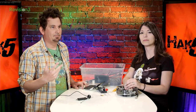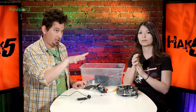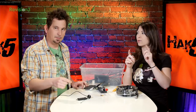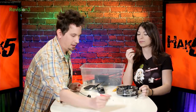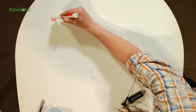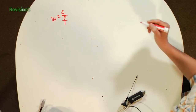It's pretty easy to figure out because we're making an ADS-B antenna. ADS-B is 1090 megahertz. And we already know the speed of light. The speed of light in a vacuum hasn't changed. And so wavelength equals the speed of light divided by frequency. I don't know what wavelength is, W? So W equals C over F.